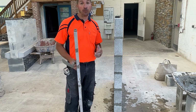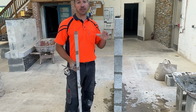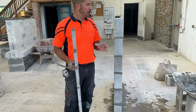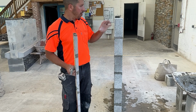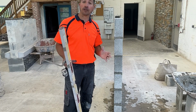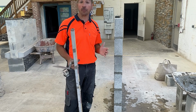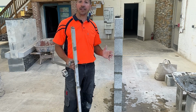Usually you're not going to be building a 4-inch block lead by itself. Usually it's going to have some type of backup. We might be tying this wall into a stud wall that's already been built. This might be a block veneer, like with the rock face block, or with fluted block, or with the ground face block, or a glazed block. Usually it's going to be tied into a backup. Freestanding, it's very unstable. You can even search on YouTube for a 4-inch block wall falling down on a bunch of guys. Those guys are professionals. A 4-inch block wall freestanding is pretty unstable, and that's what makes 4-inch block a little more difficult to work with than 8-inch block.